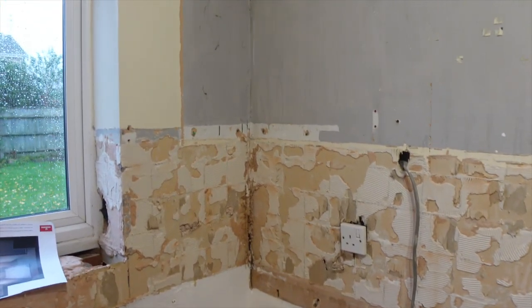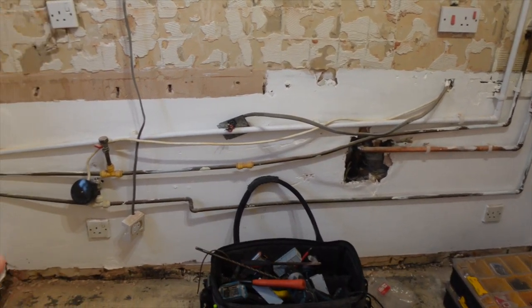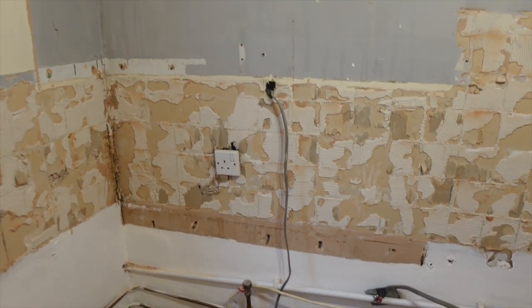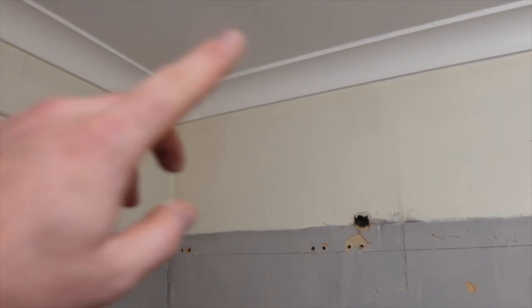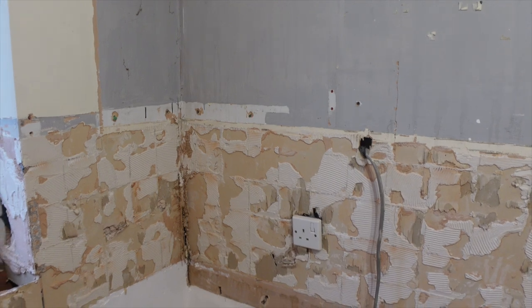It's a downstairs flat. So what we're gonna have to do is trunk right the way around the room and then chop the walls out, pop out the trunking and up to our socket points. There's no undercupboard lighting going in. Nothing happening with the lights, and we're going to do as little damage to the ceiling as we can. All we're going to do is probably break a hole out just so we can pull the old legs up and then join them in a Wago box above.